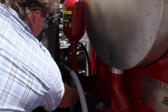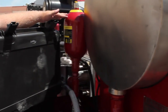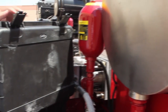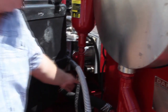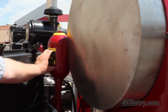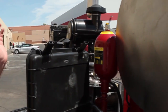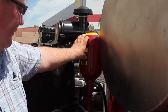This is where the water returns from being filtered. It goes into a tee right here. On the top side of this tee, we have a one gallon, 3,000 PSI suction pulsation dampener. As you run larger size plungers in this convertible pump and the plunger pulls back, you may create a pulsation in this inch and a half hose. We've put this pulsation dampener on here — you'll fill it to 50% of the nitrogen pressure of your actual water running pressure. So if you're running 80 PSI from your charge pump, you'll fill this with 40 pounds of nitrogen to act as a pulsation dampener for the suction side.